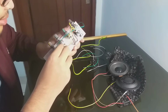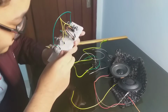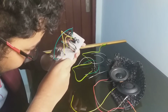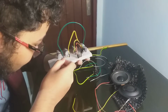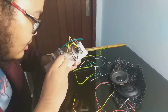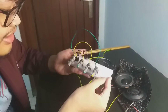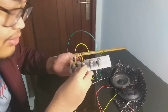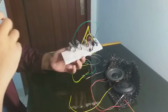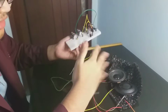Put it in here, and have the capacitor put it before the potentiometer. So we build the high pass filter for the treble. Where is it? Okay, it's in here. Okay, we just done another one. So we have the gain control, volume control, a bass control, and a treble control. Now we can prepare for the last setup, the speaker, and do the filtering.